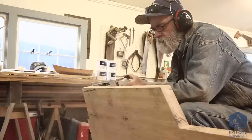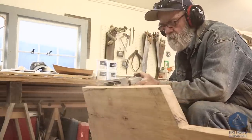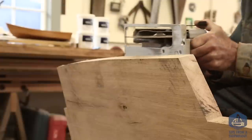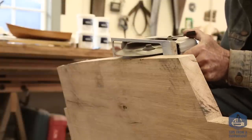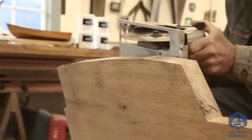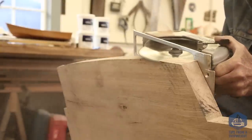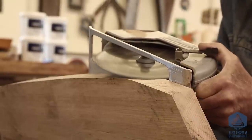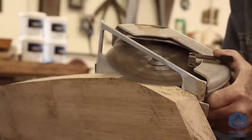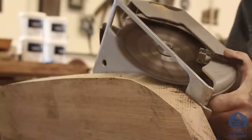A circular saw is the right tool for this job. I've already made a little cut on the very corner of the boat from the outside because I couldn't reach that from inside. Now I'm going to finish up that top cut from inside and move on to that seven inch radius. Now that seven inch radius is pretty much impossible to cut with a skill saw if you tried to follow the line around - you just can't do it, and I can't do it with a saber saw either because the wood is kind of hard and the saber saw blade would just wander all over the place and it would be a mess. So I want to do a nice job with this circular saw and the way to do it is in little tiny bits - make a nice little straight cut and knock one little wedge off, then just change the position a little bit and make another cut.